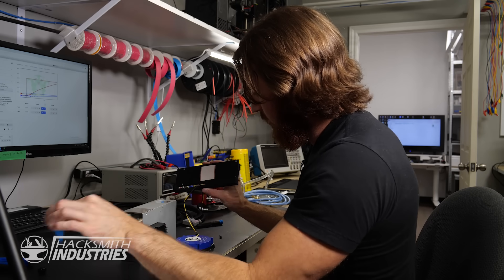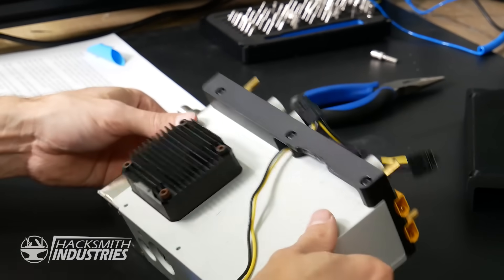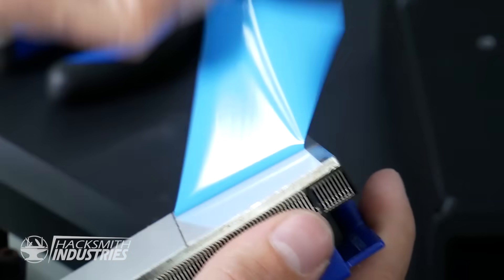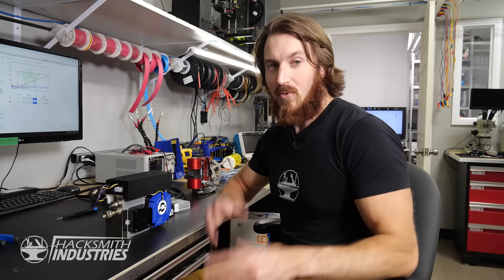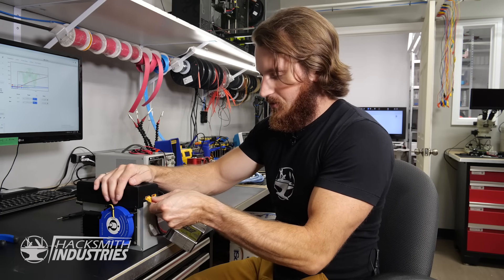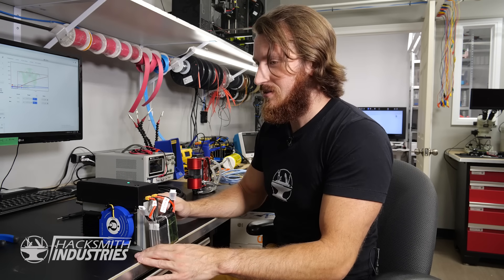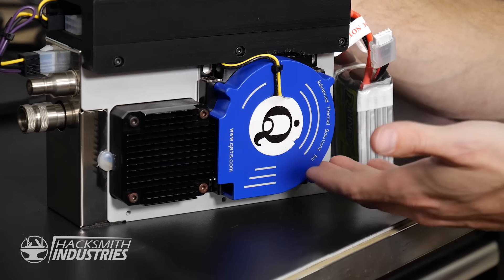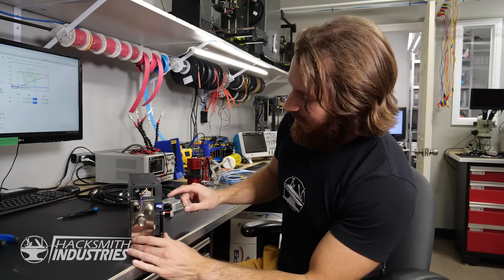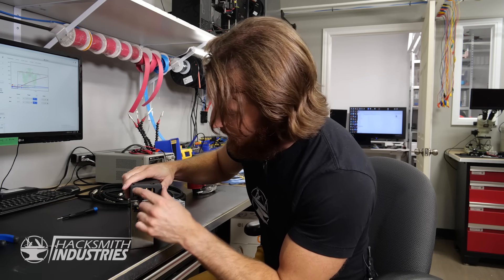Let's build this up. Removing the thermal adhesive wrapper — make sure I put this in the right spot, that's not coming off again. On the back end we plug in two batteries, which will run the system for about 10 minutes straight, which is pretty good especially considering it's the highest power laser. The fan and reservoir keep the driver cool. The pump is actually integrated into the reservoir, and then we have our trigger switch — if you put a switch in that shorts that, it'll trigger the laser. The 8-pin output is for the actual laser.